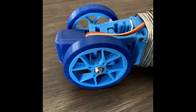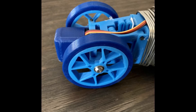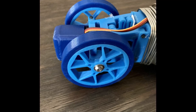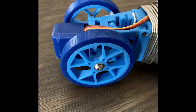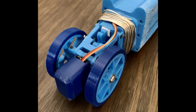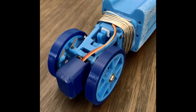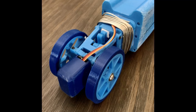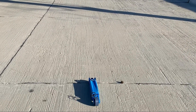The next test was to widen the front track by 14 millimeters, going from 50 millimeters to 64 millimeters by extending the knuckles themselves. This proved to be a huge improvement in handling, but tram lining of the narrow tires was still terrible and causing the gyro to go crazy. The next test was wider tires — keeping track width the same for a relevant comparison — going from 4 millimeters wide to 10 millimeters wide. This was a huge leap forward driving on a concrete road and caused the car to tram line much less.